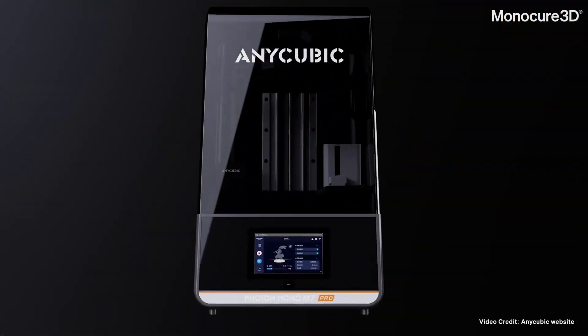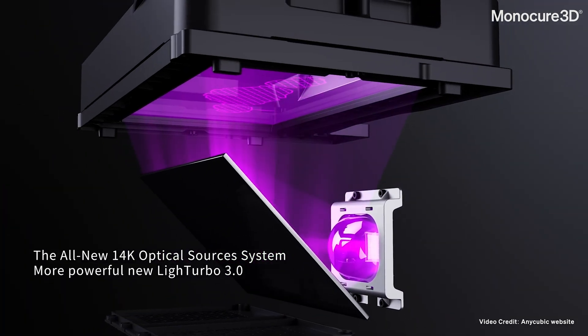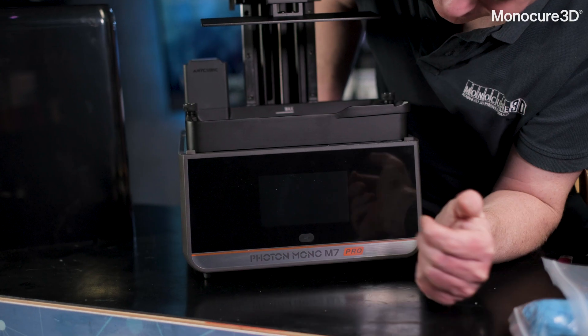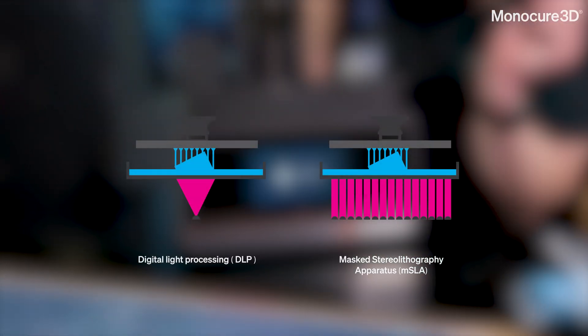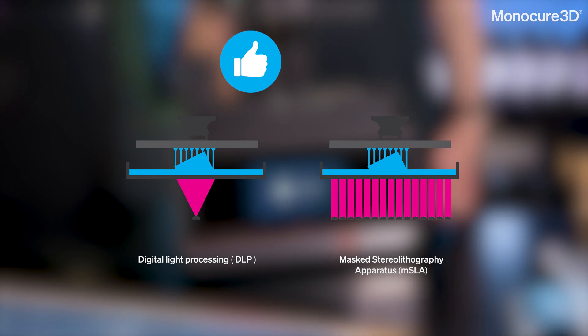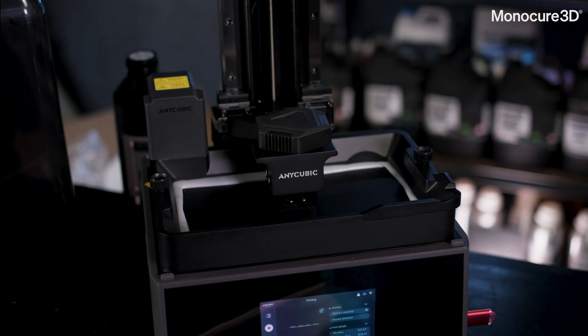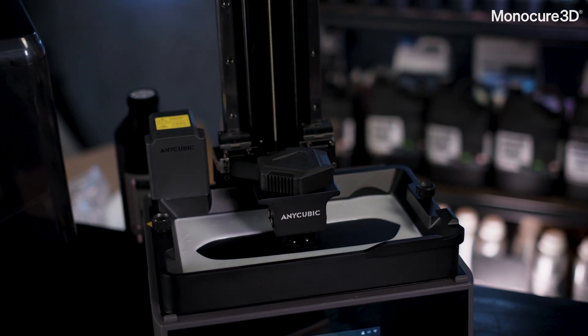What exactly is the LighTurbo 3? It's a COB, or chip-on-board, light source system, paired with a special lens and a front-facing reflector. I have to say I'm not a fan of this system and I'm surprised to see Anycubic go down this path. Even light is essential in resin printing — that is why the DLP system was always considered superior to the MSLA system. Uneven light distribution can lead to inconsistent curing across your model, causing defects, inaccuracies or layer misalignments. I'll have to do some more printing with this to properly gauge whether the LighTurbo 3 is an advantage or not.